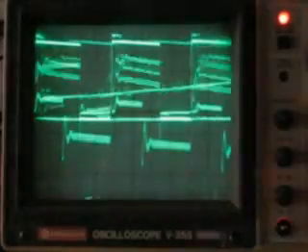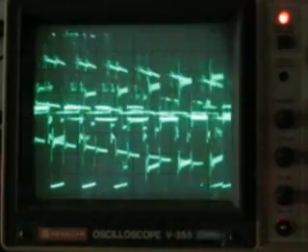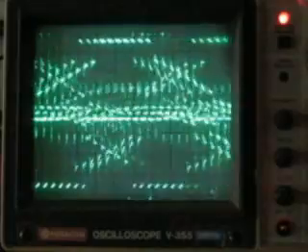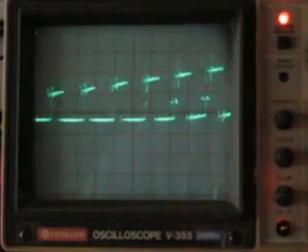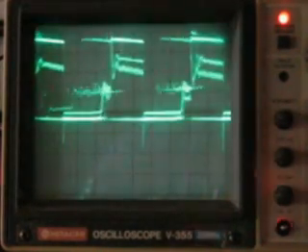It's a very complicated waveform as you can see. You can see the aliasing going on inside the pulses. We're at 50 microseconds per division, so you're seeing about 80 microseconds as the pulse period on the waveform.